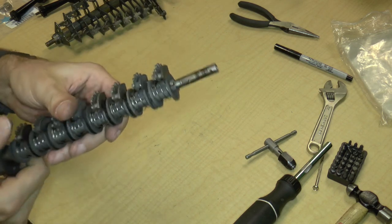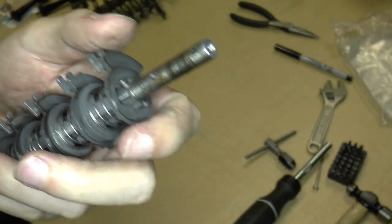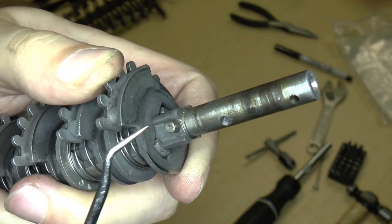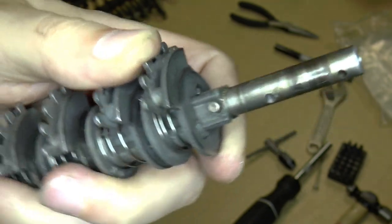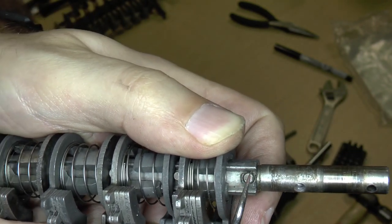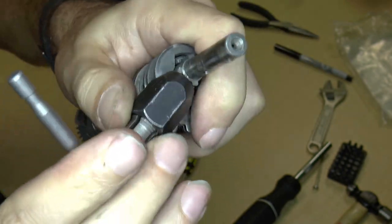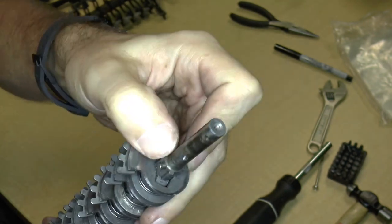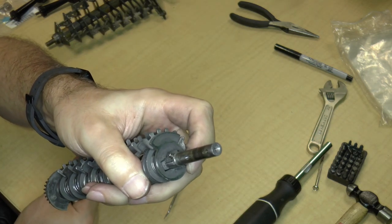When last we left, I was going to look at these pins at the end to see if I could take them out. I'm actually thinking that they are permanent. I looked at them under a microscope and you may be able to see there are these marks on the sides of these pins here and here, and these semicircular marks over here. What I suspect is they had a tool — maybe something like this — and used it to bang the pin into the hole, which was slightly undersized. These are basically interference fits, meaning the pin is slightly larger than the hole, which is meant for absolutely permanent fixtures.